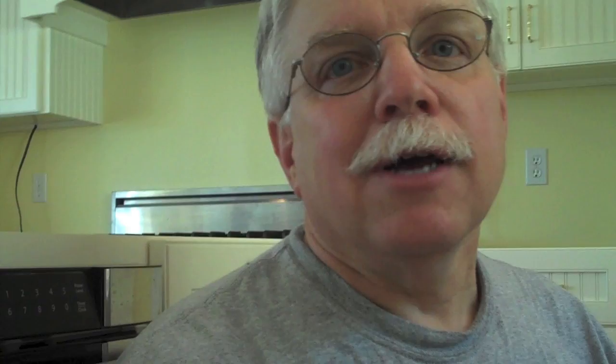So installing an Apron Sink is really simple. Use ¾ inch plywood, make sure those 2x4s are screwed securely with many screws to the sides of the sink-base cabinet, and your Apron Sink is not going to fall into the cabinet or cause any issues. I'm Tim Carter for AskTheBuilder.com — if you want to discover more home improvement tips, go to AskTheBuilder.com.